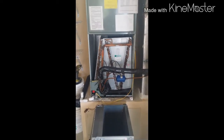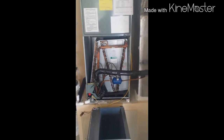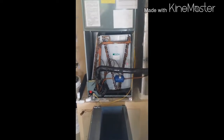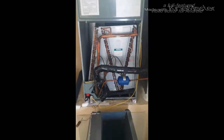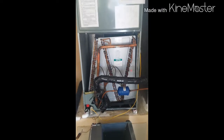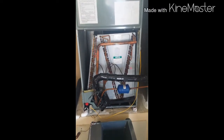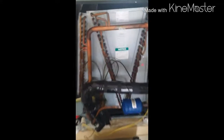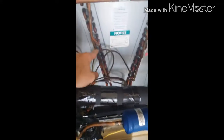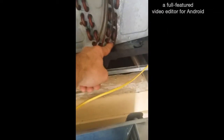Between the years beginning like 2008 to 2012, all the manufacturers were shipping the coils overseas. They were mixing the copper with different kinds of metals, causing the copper to lose its strength and it was just leaking out refrigerant. There's two pin holes in this copper — one's there and one's right at the very bottom where all that rust is.